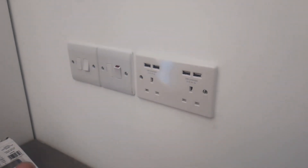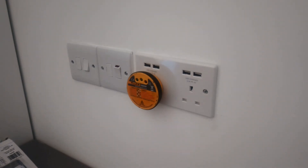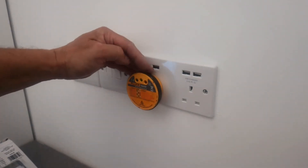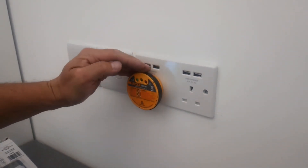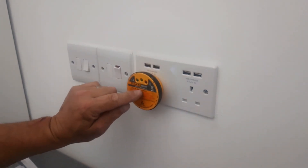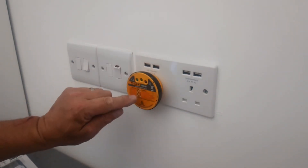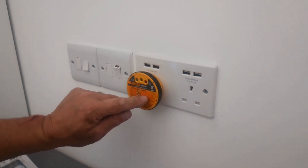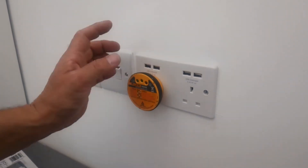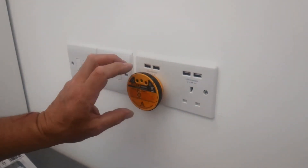That's done. Plug that in and go back and switch the electric on. As you can hear the whistling's going, which means it's all connected properly. If you do have one of these testers, they're very good — the two green lights being on tells you the wiring's correct. If the red one flashes or you get an alternating light pattern, it will tell you it's got a missing earth or a live-earth reversed. So turn the power off at the fuse board again, take it off, change the wiring around, connect it back up, plug this in — away you go.